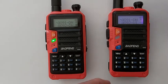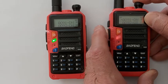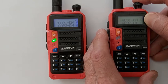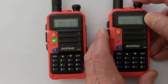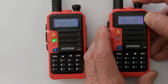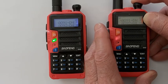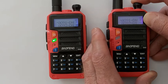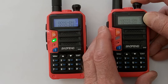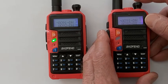So let's exit that. Now I'm going to press PTT and you can see it did the five bars thing when I let go of the PTT. Now the strange thing is it's intermittent — if I do it again, it doesn't do it. And there it is again. And that time I got the antenna symbol but no bars, and you can hear it cuts for a while.